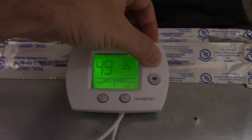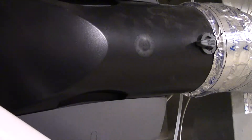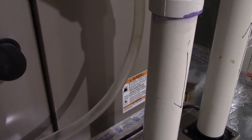I'm not going to do a shutdown sequence this time, but let me see if I can show you the humidifier operating. We'll just go ahead and raise up the humidity level. Maybe you just heard that click right there, and there's water going through the tube right now. Not much to show around, but maybe you'll see water come down the tube pretty soon and go into the condensate pump. It gives like a gentle hiss because the water pressure in this house is really good. It doesn't use too much overall, so it takes a little bit of time for the water to get in here, but eventually it does.